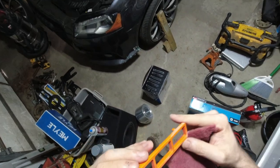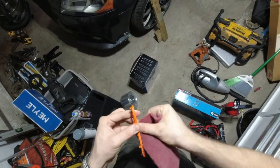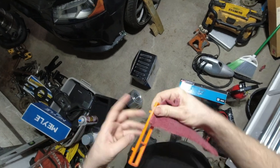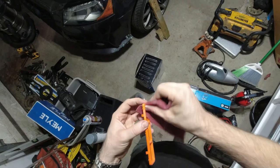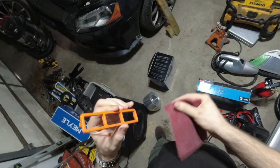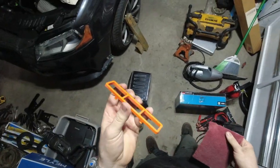because it's a metal brace through the center of the keyboard, and the switches go in from the top, and then they're soldered onto the PCB below it. So I would have to unsolder every single switch in order to take that metal bracket off, and the metal bracket is what I want to paint white, so that way the lights shine through a little bit better. So that means that I have to put it on with a brush. It's not going to be the end of the world or anything. And it's self-etching, so it'll adhere to the metal.